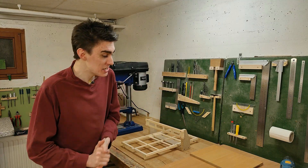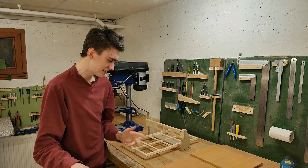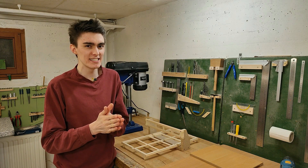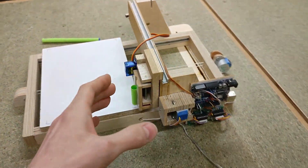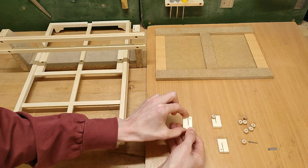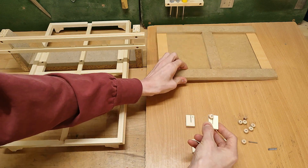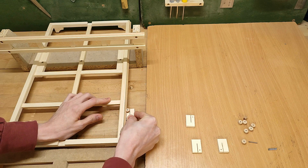So far so good. Since I can guarantee you that my linear rails are not parallel to the micron, nor would I ever expect them to stay that way considering the whole thing is made out of wood, the design has to make up for small inaccuracies as well as expansion and contraction of the wood. If it doesn't, I'll get the same issue I had on the old pen plotter, where the carriage will be snug on one side of the axis but wiggle around loosely on the other. To avoid that, I have these plywood blocks with a cut on one side to which the rollers get mounted, and these in turn then screw to the print bed, effectively spring-loading the rollers so they always push down on the rails to make up for these unavoidable inaccuracies. It's quite a sophisticated mechanism.